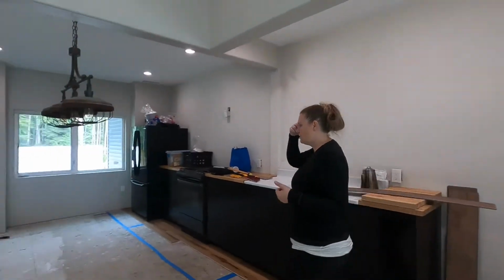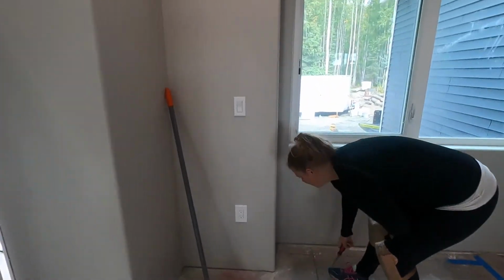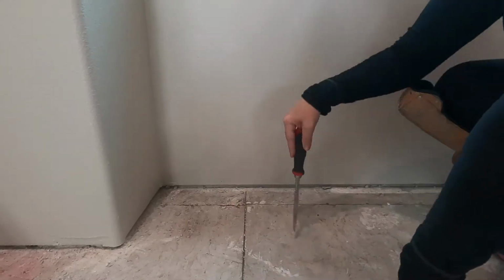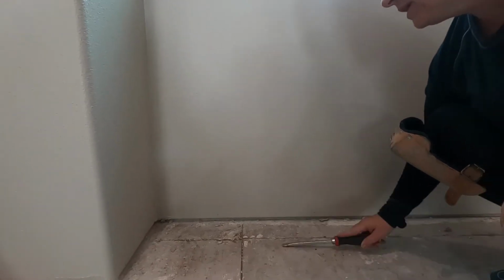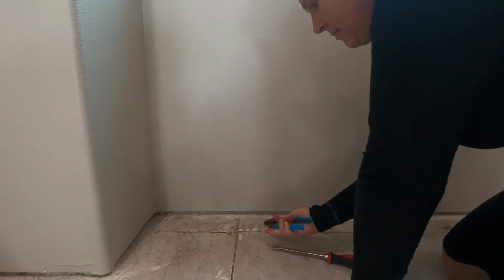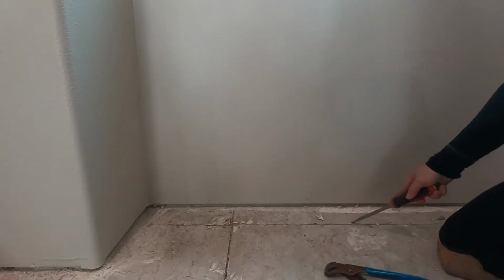So Cody and I are showing down here. When they did the drywall, they come through and they do some cleanup, but not all. So I come along first with a screwdriver, and what I look for are all of these staples. And you would not think that a staple that size makes a difference, but truthfully in this laminate flooring or vinyl flooring, it does.